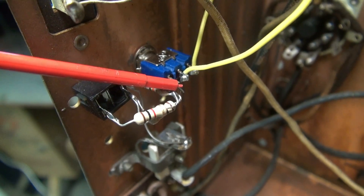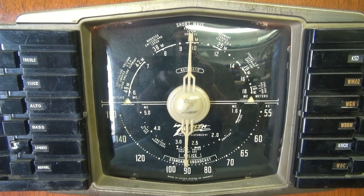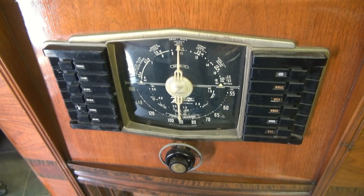For your reference, I've included a simple schematic. You can see you've got your input jack through some resistors to your selector switch. In one position you have MP3, the other position you have your tuner input, so you can run the radio as-is or flip it over to MP3. Take a look at the diagram — you can do this very simply to any tube-type radio without fear of damaging your MP3 player.